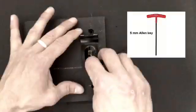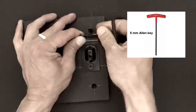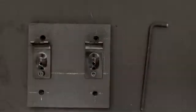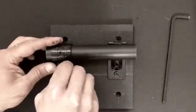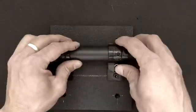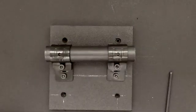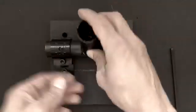All of the nuts and bolts are tightened using a five-millimeter Allen key. We'll place our first pipe on top of the H16s and group the H16 with the H15 — together they become the HJ-15 joint set. From there we finalize this step by installing an HJ1 joint set.